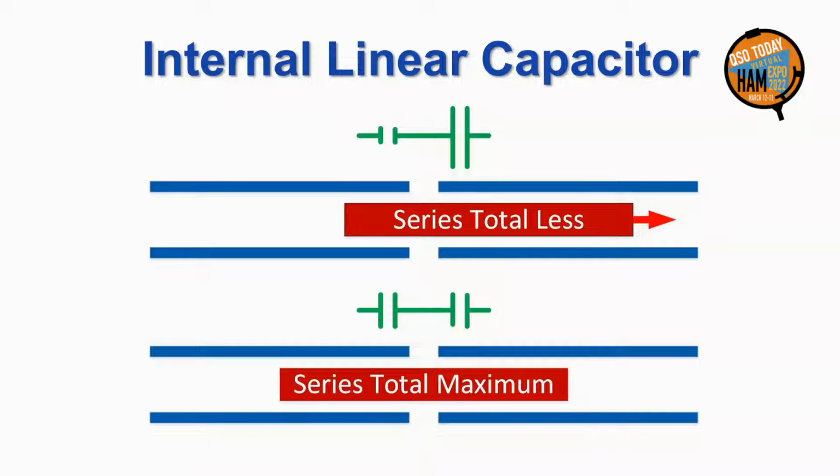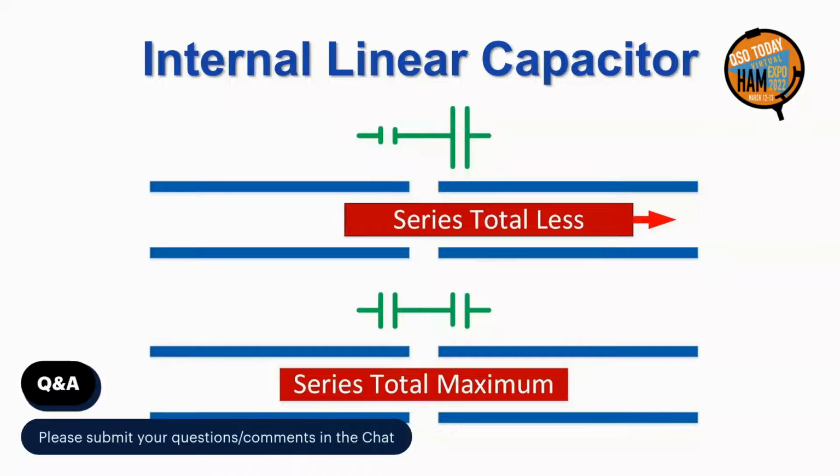Here's how it works. Inside the loop, by straddling the outside foil gap with a smaller foil-covered movable PVC pipe section, also covered with foil, 2 capacitors in series are created across the gap. If the inside pipe is centered across the gap, the capacity is maximum. If it is off-centered, the capacity is less. This design is also weather protected and has a high voltage rating.